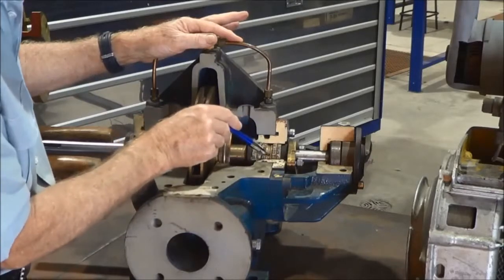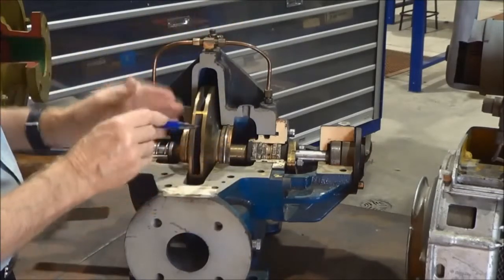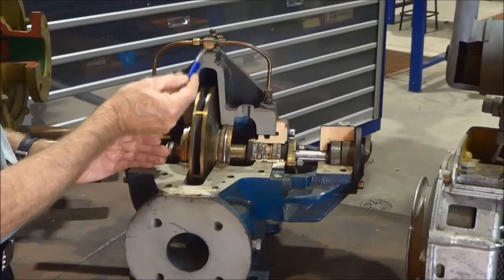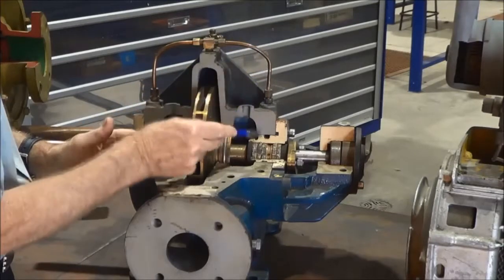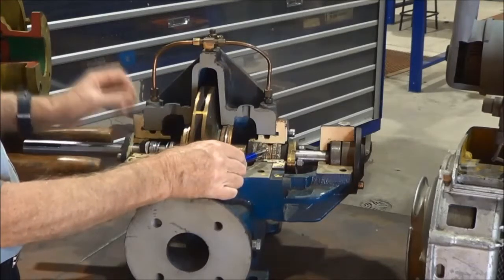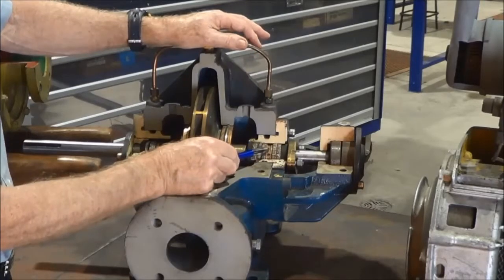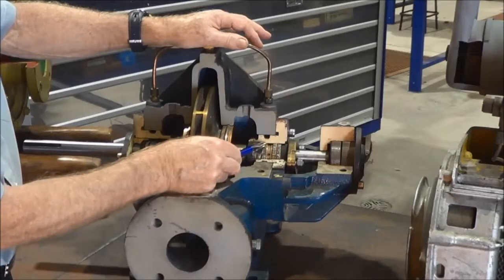The lantern ring is a loose fit around the shaft and into the stuffing box. The purpose of the lantern ring is: as the pump rotates and expels the water, the high pressure is bled off down through cavities in the pump housing, it reaches the lantern ring, and with the recesses and holes in the lantern ring it allows the water to circulate around it.